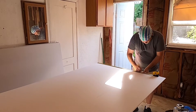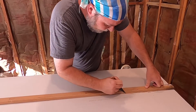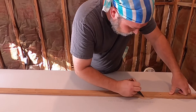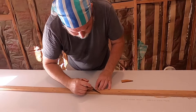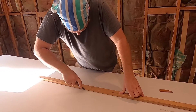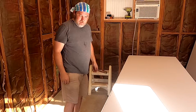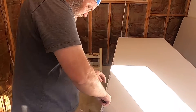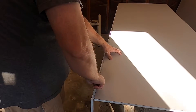Now it's time to measure out those boards. Don't forget: measure a bunch, cut once. All you got to do to cut a nice straight line in your drywall is score it with a sharp knife and then just break it off. Use your knife to cut through the paper on the other side and you're good to go.